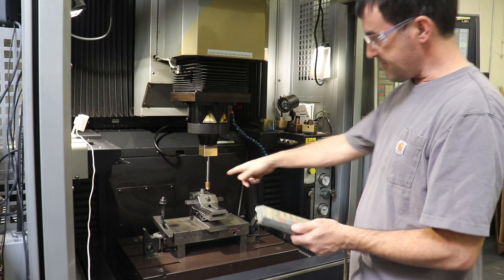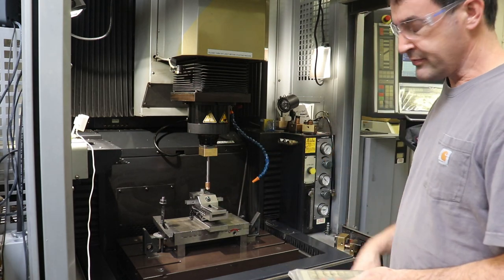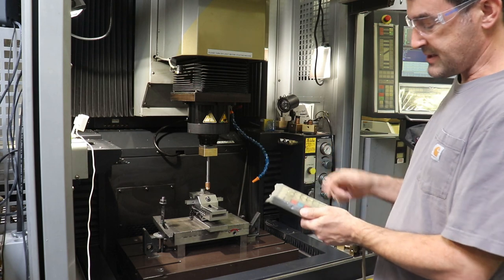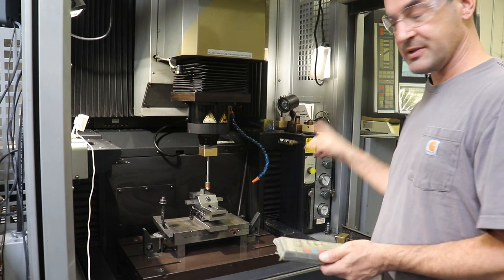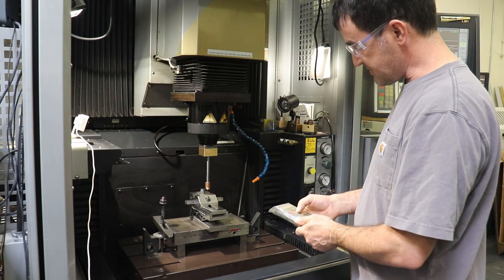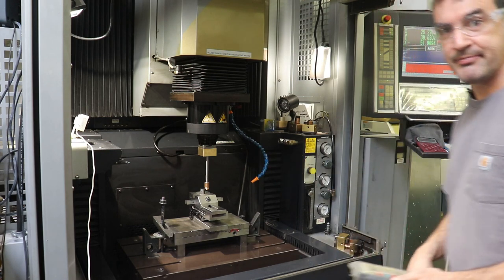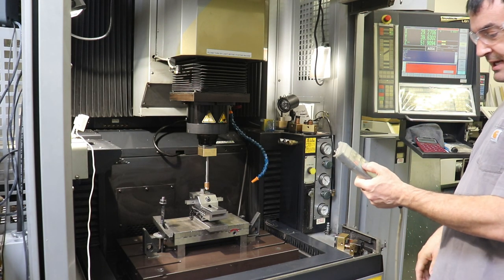So what I'm going to do is move this electrode over until it just touches the steel, and then the machine will beep and stop because it detected a collision. As long as you go slow enough, it won't damage it or anything, but then we'll know that we're on the edge, and we'll set that in the controller. We'll just move the X over, and then that beep says, okay, you touched. And then over on the controller, you can see a warning, so we'll acknowledge that warning.